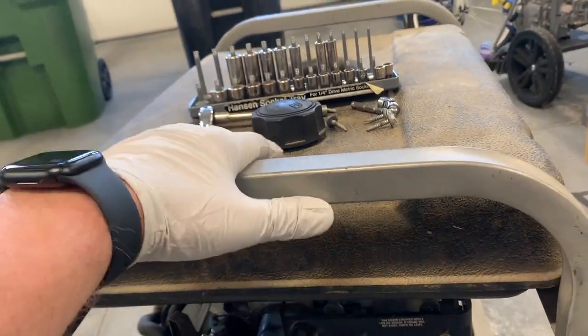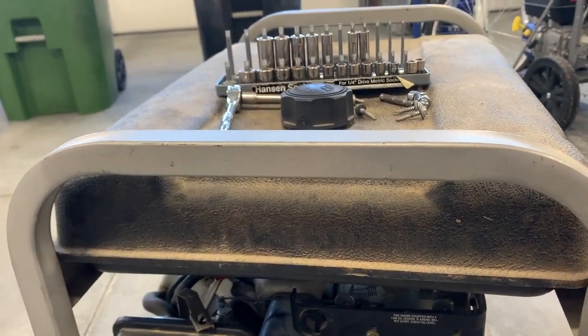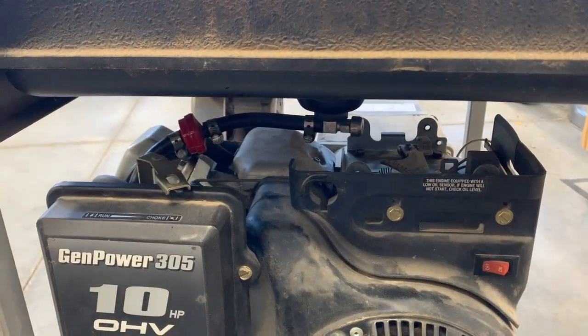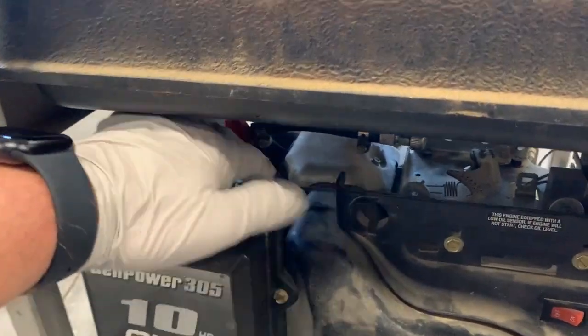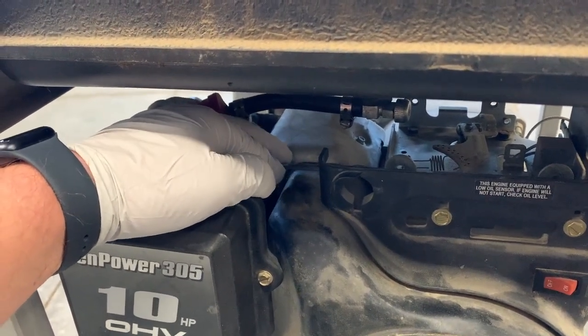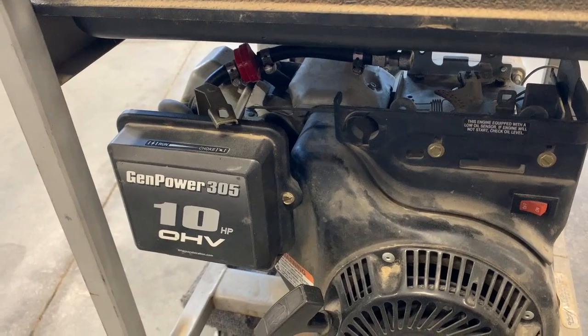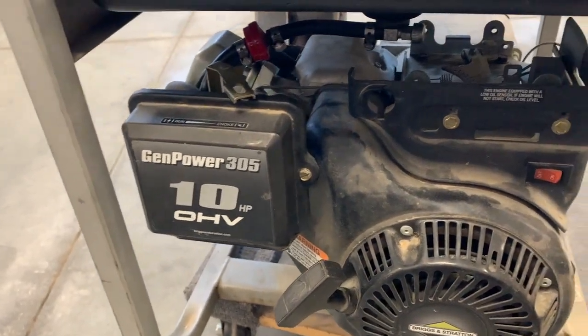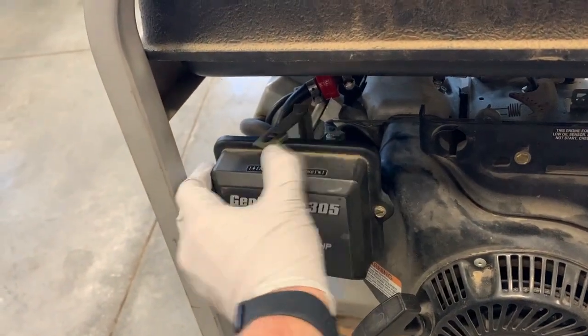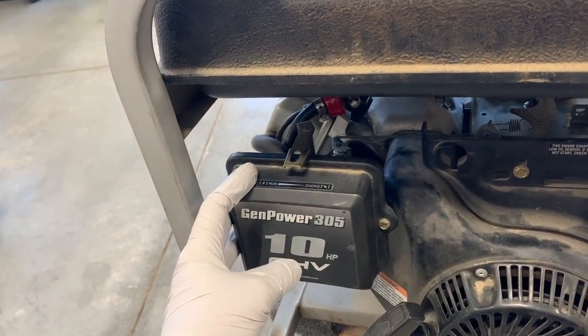Although I've done this a couple of times, I rinsed and flushed the gas tank. The gas tank is old — it's chewed up on the inside and needs to be replaced. This assembly right down here is the governor assembly with the throttle, and the spring linkage is all messed up. From when I used to work on go-karts, that will cause your engine to not idle right. On top of that, the carburetor's high-flow jet is plugged up, which causes it to die out when I go from choke to run. So we're going to be replacing that stuff today.